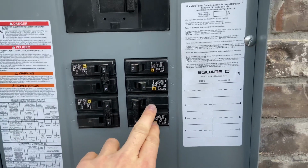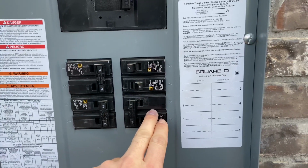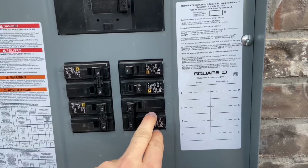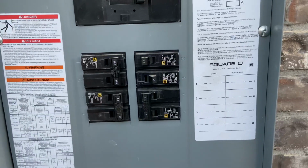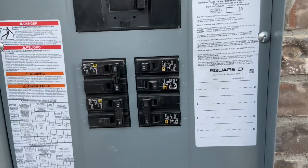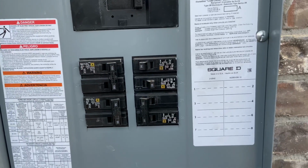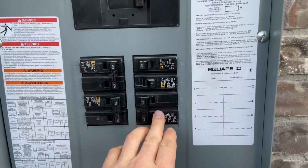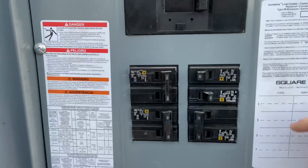And I won't travel down to the gate to show you, but basically the idea was I've got 1 circuit for the switch, cameras, gate control, everything like that, and I have another circuit for any lighting. And last I did the math, each of those circuits, I should be able to pull about 5 amps before I start to get concerned about voltage drop. Which is plenty for LED lighting and what I need to do. So it's a little overkill, but it was easy enough to do.